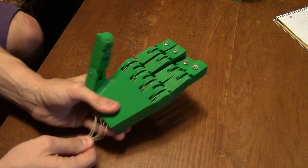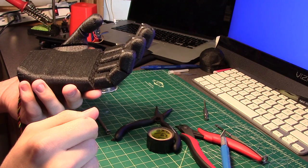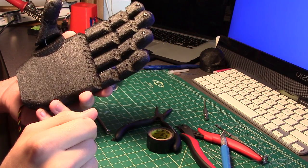So these gave me a lot of insight about what I liked about my design and what I didn't like about it. And you can see on the top, there's a hitch that I designed for interfacing with different hands. So I've gone through a lot of different versions of how the hand should actually be designed and how it should open and close and what makes the fingers return back open. Like you guys saw in the very first one, it was just dental bands on the back of fingers and I was pulling it with hemp cord, that old green one. And then in the last version, I had the whole hand be NinjaFlex, which was good for some reasons, but also for others, it was not very useful or practical.